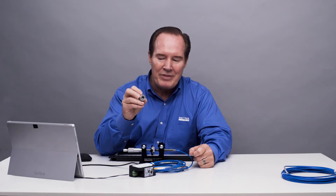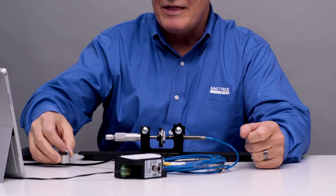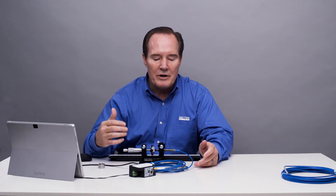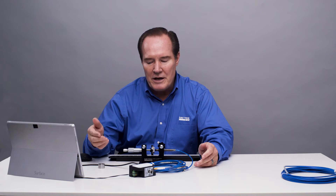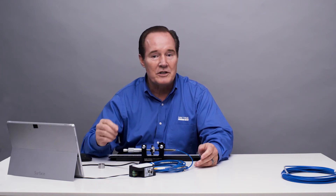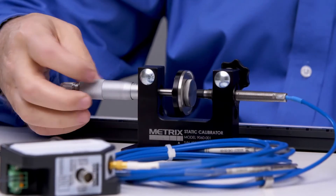We're actually going to see how the probe performs in a tight situation. We've already shown that it works in a linear fashion for a 5-meter system looking at a 41-40 target. What we're going to do now is reconfigure the DPS software, put the fixture on, and run a curve to see if we can still make it linear. So let's go ahead and put on the fixture.